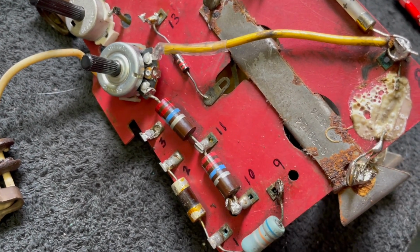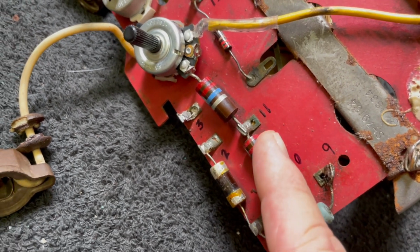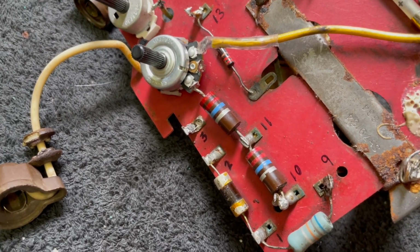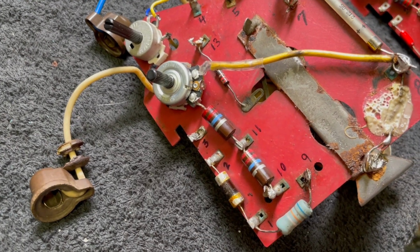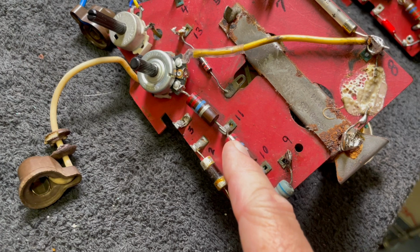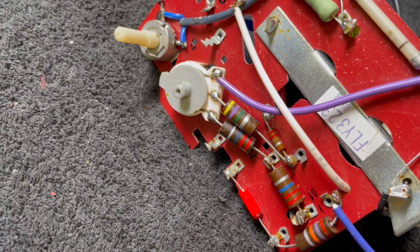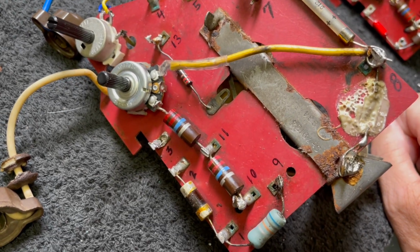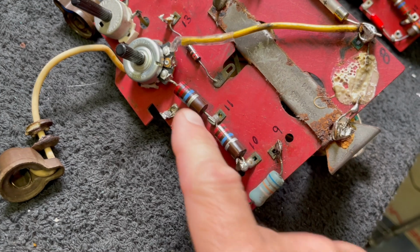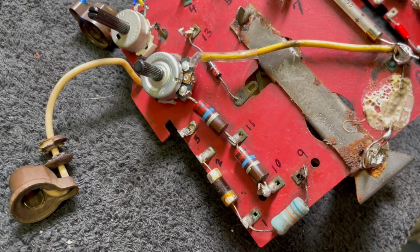I mean, I spent a long time searching on the Mouser website, and they have metal film resistors. They have 22 meg resistors, but they only go up to 1 watt. So, I mean, I don't know. You can maybe put 1 watt resistors in here. Maybe it'll be fine. I don't know. But to find 2 watt resistors that are these big values, 22 megs, and in this particular case, a 4.7 meg, I've just had to go to eBay and find vendors that have old stock material. So, not sure what to really think about that, but by the time you add it up, you place an order for, someone has 2 of these, and you pay $8 for the pair, and then $8 for shipping. Before you know it, you're close to $20 for just 2 resistors.